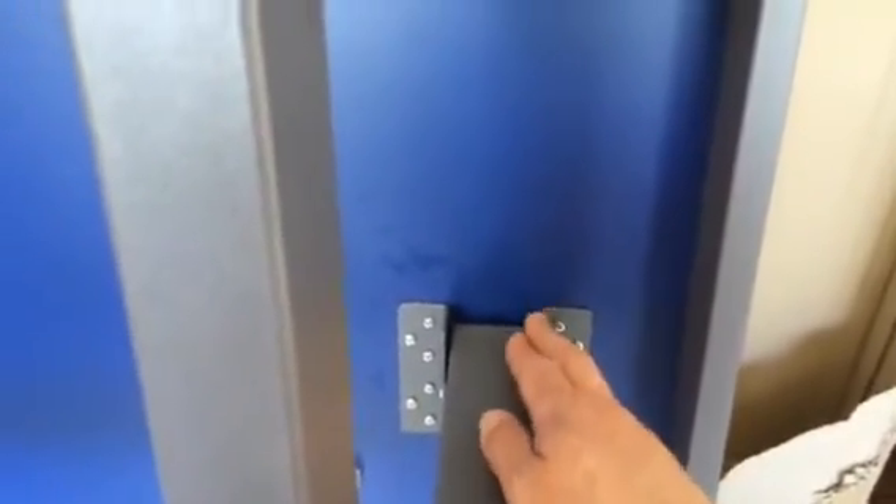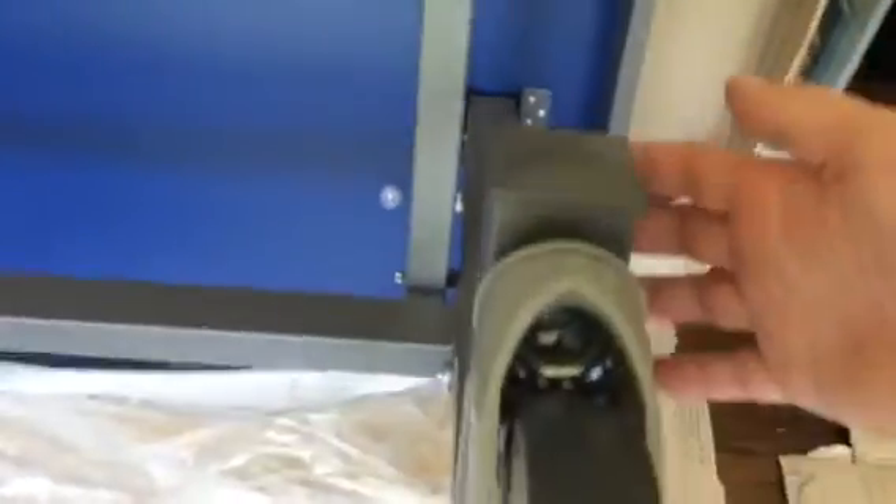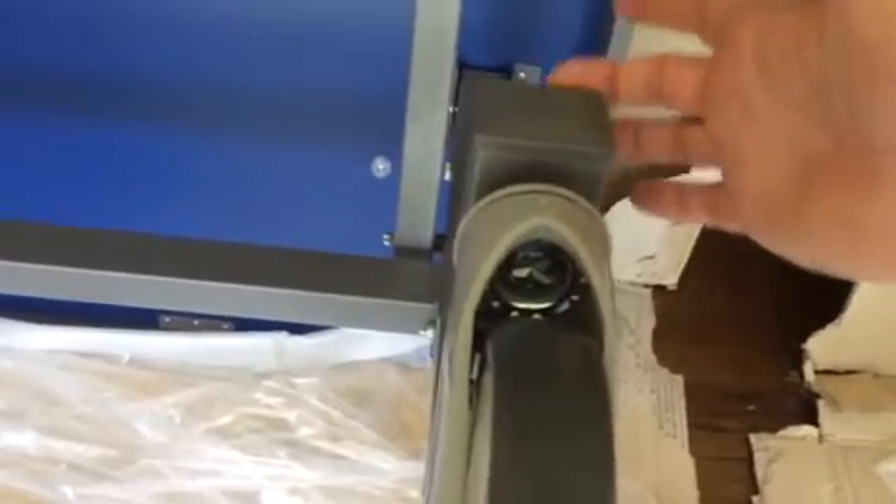The other most important piece is that when you're putting in the wheels and the table legs, this part right here that connects to the wheels — it's very important to have it high up in the bracket. You want to put it high up so there's only a little bit of space at the top and more space down at the bottom. There is also a little yellow label on this wheel with an arrow that points up, which helps make sure you don't assemble the wheel arms backwards. Again, very important to position it up close to the end of the bracket and leave more space underneath.